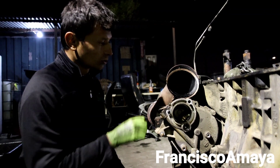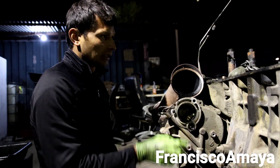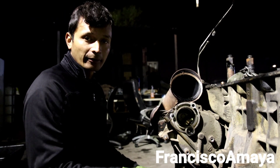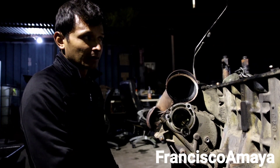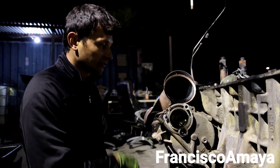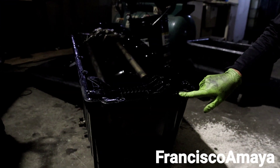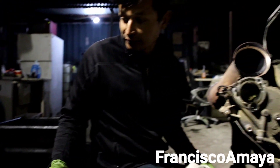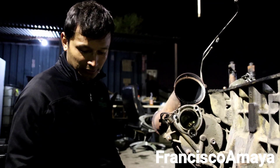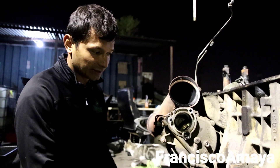Also there is a lot of oil here - or fuel - that probably came from the pistons when the engine got completely over-revved and probably stopped immediately because of the bearing seizing, or the driver trying to stop the engine. Probably the fuel injectors didn't resist and started throwing a lot of fuel. That's probably the reason why we have a cracked oil pan - the fuel went in there and exploded or something like that. That's the only reason I can see, because this aluminum is super light, probably like three ounces - it's not heavy enough to crack the pan.